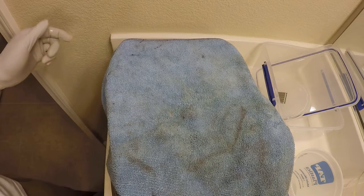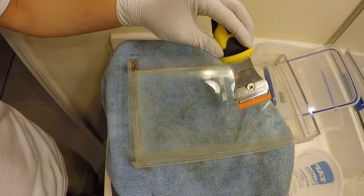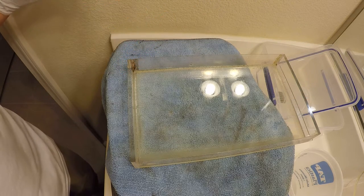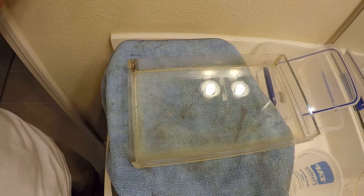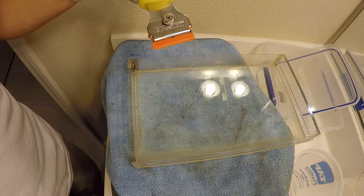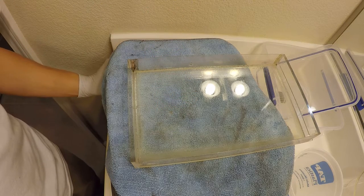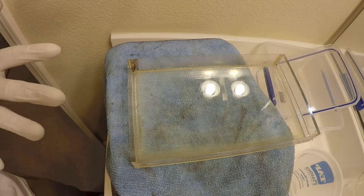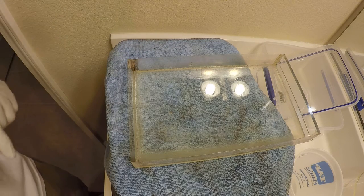I'll have to clean up this vat. There are two spots that have gotten a bit of resin, including where the lift occurred. I need to clean that up as much as possible while maintaining the smooth finish of the rest. What I don't want to do in the process of cleaning is accidentally damage the surface elsewhere — which means no touching the silicone. I might try rinsing mainly with IPA rather than rubbing with anything. Maybe when it's wet I could use gloved fingers. Definitely no rags, nothing cloth or rough.